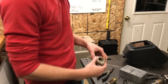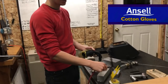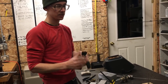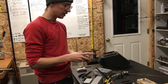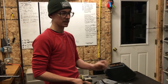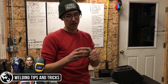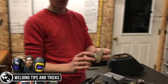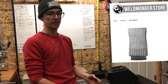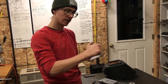I like to use cotton gloves. The black ones are a little bit thicker and the yellow ones are a little bit thinner. The torch gets hot when you're steadily welding so I like to use the thicker black gloves on my right torch hand and the thinner yellow ones on my filler hand where I need a little more dexterity. Sometimes I just weld without a glove on that hand because I tend to not feel like I'm risking burning myself. I also have a TIG finger — Jody from Welding Tips and Tricks markets and sells these. It's really useful, you can see the heat marks from different times where it saved me from getting burned.